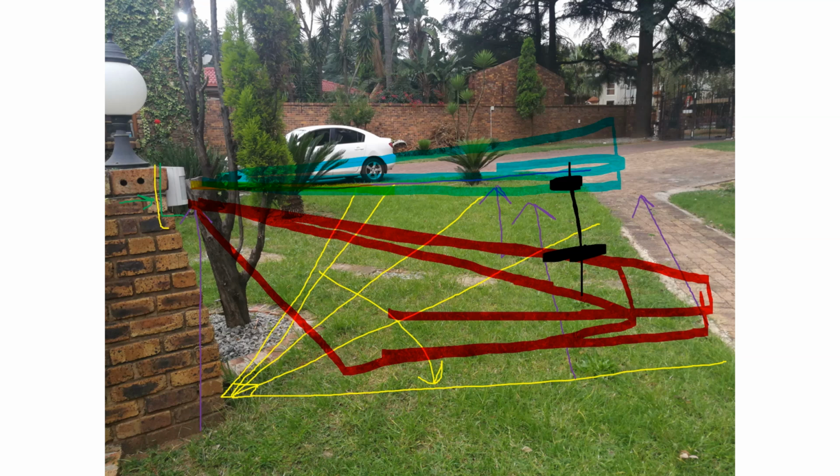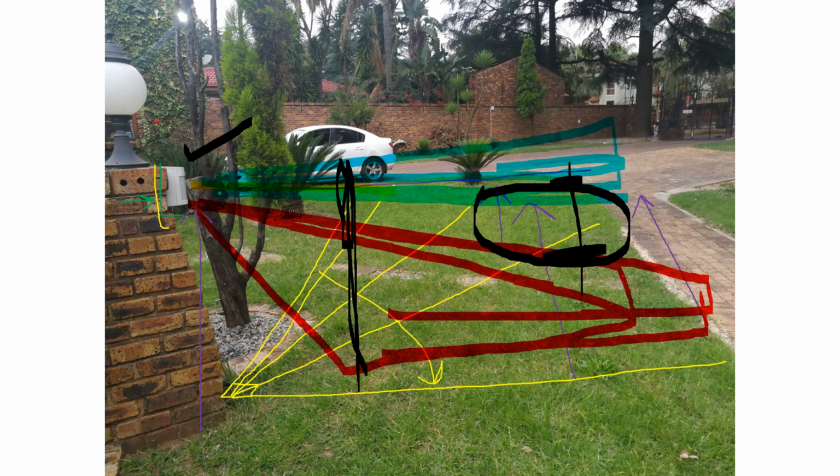then the alarm activates. So if you're standing over here, you literally need to be off the ground 1 meter, and there you go. You're going to break that zone of protection. And you can see this one's actually a little bit lower, by the way. So you need to break both of these detection zones in order for the alarm to trigger. That would mean you'd have to be literally 1 meter off the ground, or a very big animal over here, I mean like a really big dog. However, if you're over here in this area, you can see that your size is now less than half because of this incline. Because of the incline in the land, the detection zone is allowing for a smaller or more sensitive outcome.